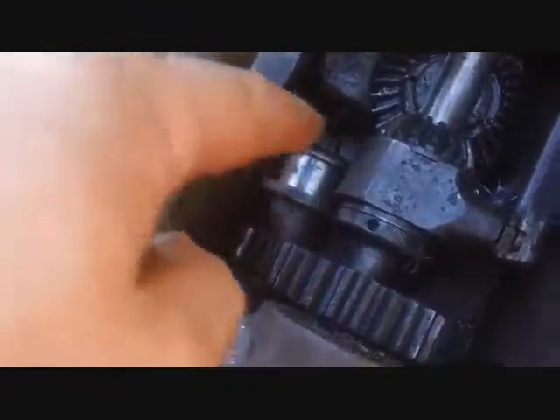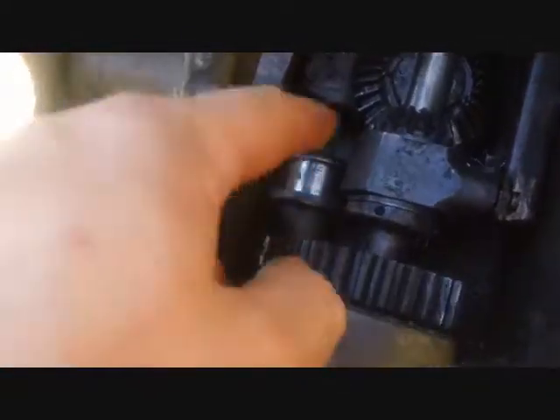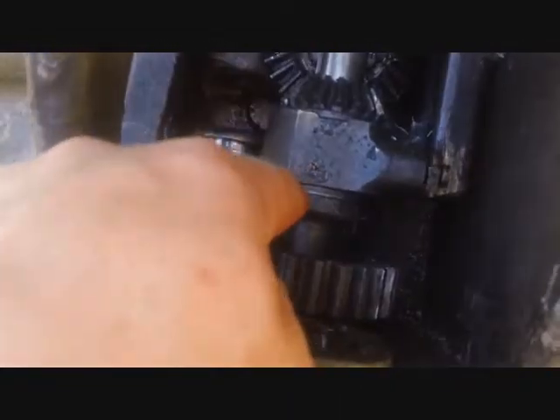I actually can't get that gear out. After I slid the shaft out, the gear falls down behind there and it won't physically fit through between this wall and there. There's a hole in the side here but it's way too small to be of any use for getting that gear out, so that gear is not going to come out until this assembly is out of the way. Not knowing exactly what to do next, I noticed these little holes here — this looks like a spanner nut — and I tapped on it with a punch and sure enough it's unscrewing.